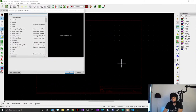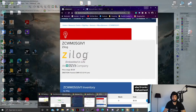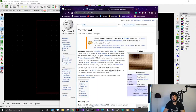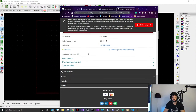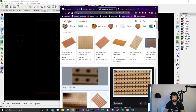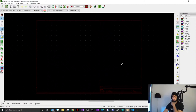Elias, yeah, so we did breadboards and what we call vero boards. I think other people call them proto boards. We always started with a breadboard and then we'd solder onto the vero board. We use the vero board to make our beam bot and stuff like that. But it's still good to use a breadboard. You'd rather do it on a breadboard than on a schematic, then make a PCB and find there was a mistake that you could have seen earlier.